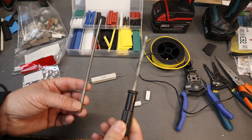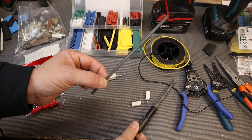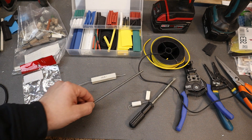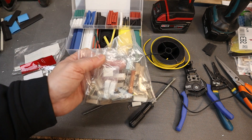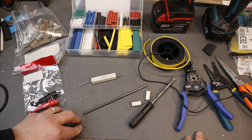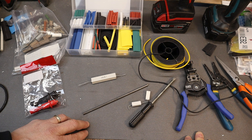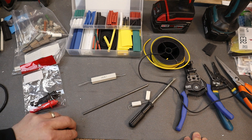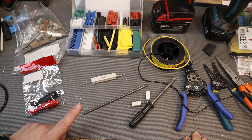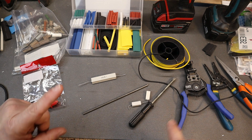At the workbench I have an old screwdriver with a plastic handle, and some metal brown quarter-inch round stock — both will work. I pulled some resistors from my parts bin. What we're dealing with is an RC time constant — resistor-capacitor. We don't want a resistor too big that it takes too long to discharge, like 5, 10, 15 seconds — that's a waste of time. But we also don't want it too small, because then it may create a spark or arc and damage equipment. We want just the right size.